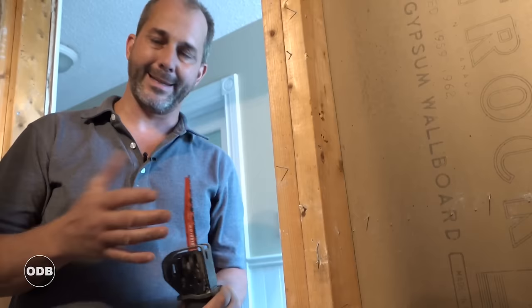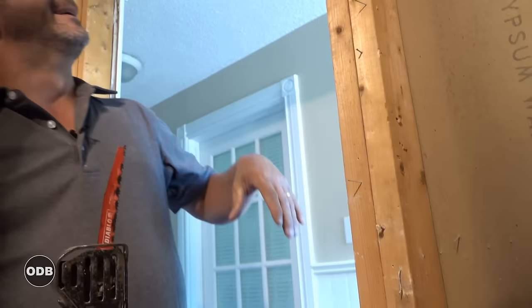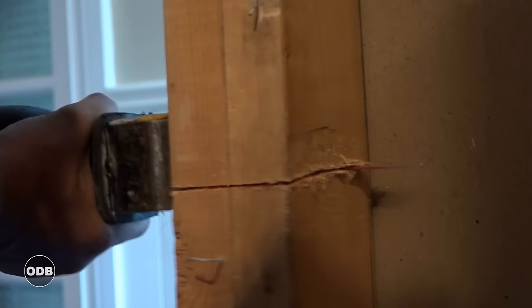As I'm cutting, there's no binding on my blade — lots of jiggle. Usually that translates 99 times out of 99 to a non-structural wall, but because we have a header like this we're going to brace it anyway. Better safe than sorry — I'm not an engineer and I'm not going to pretend to be one.